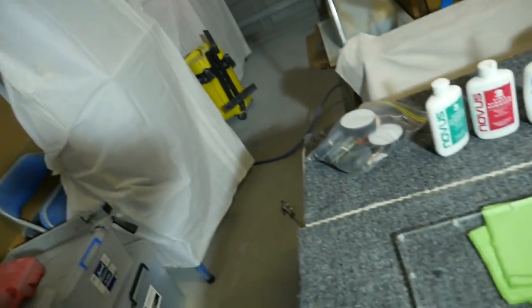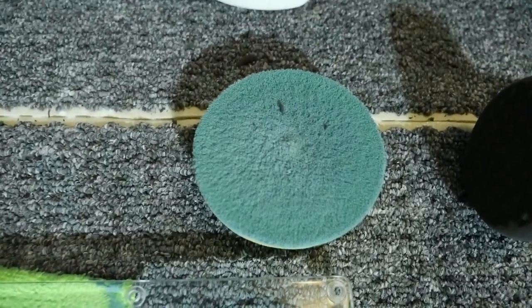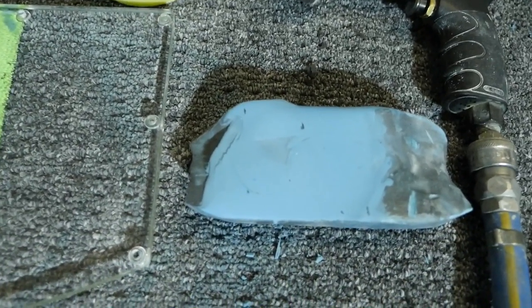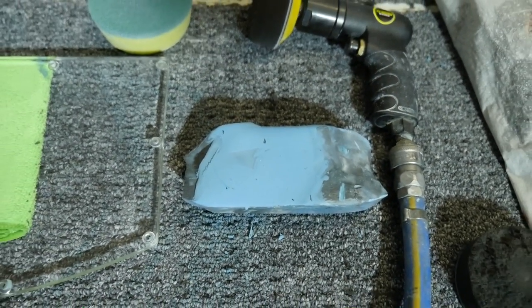And it's the same concept with the polishing attachments as it is with the sandpaper. So if it's taking too long to remove the scratches with a certain sandpaper grit, we'll then drop back to a coarser sandpaper grit. So I experimented with that. I tried some coarser polishing attachments. I tried a wool polishing attachment, but I didn't really like the results. And something that I've experimented with previously, and I've had a few people tell me, is that you can use metal cutting compounds to polish plastics and to polish acrylic, and that it works extremely well. So that is what I decided to do.